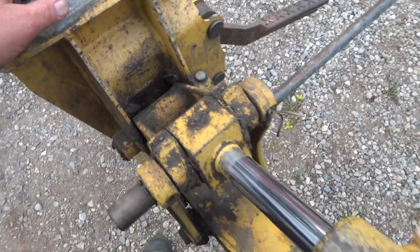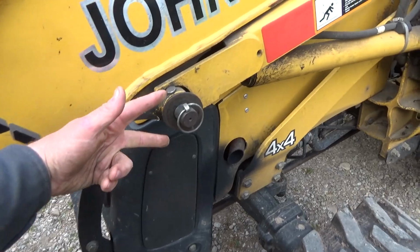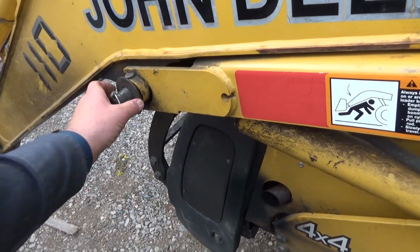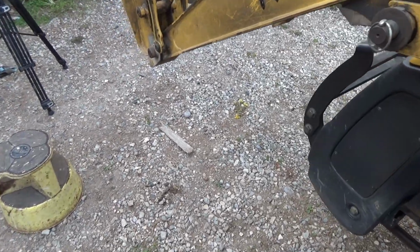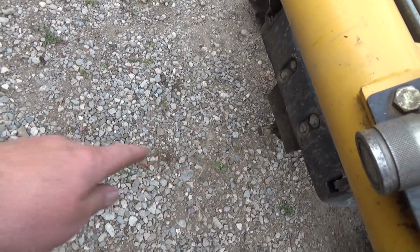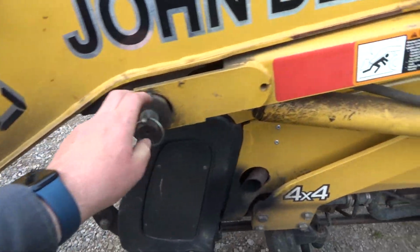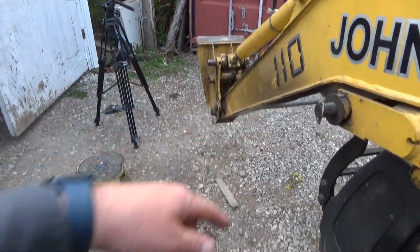and that's still factory, but they changed the pins to attach these great big plates, and one has like a slotted end, so you can only lift this up so high, and these big plates were supposed to stop the action of the lift, which I didn't really like too much. That way, if you lift your blower up, it doesn't separate from the PTO down there. So I didn't particularly like that. So these ones here limited the entire lift, so you can only go up so high, so it wouldn't separate.